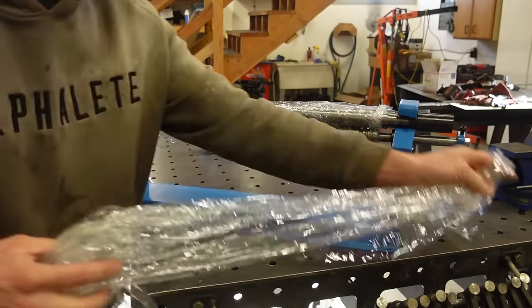Well, we have made some really good progress. I got both rocker panels all done. Now, while they aren't perfect, they're definitely good enough for the tools we had. There's low spots here and there. All this, I mean, I bent all this with a hammer, so really can't complain. Couple little scars from just grinding it, but I don't know if I will, but a little bit of filler will fill that right in. There's one low spot right there, which I didn't want to grind too much. That's just a light coat of filler. Other than that, we're looking really good. So I'm happy with that.